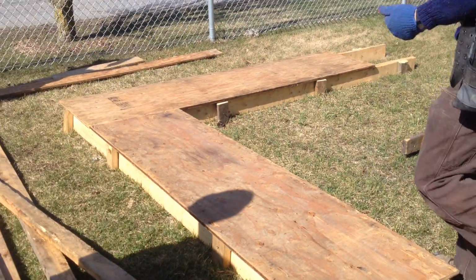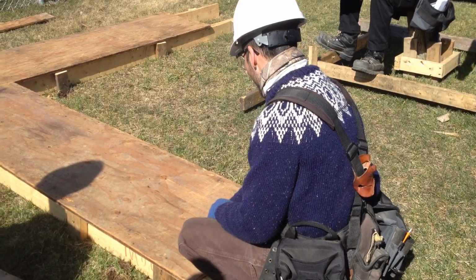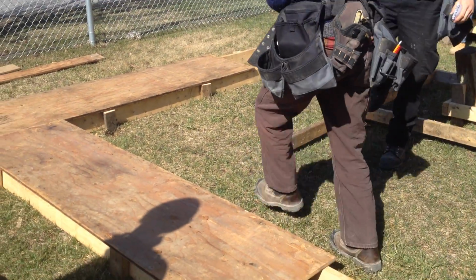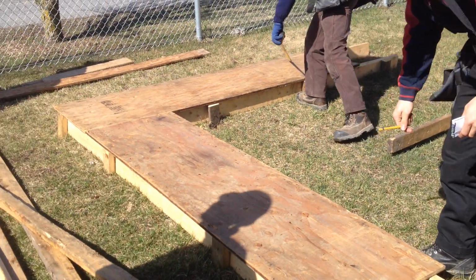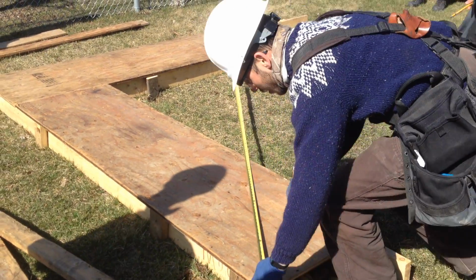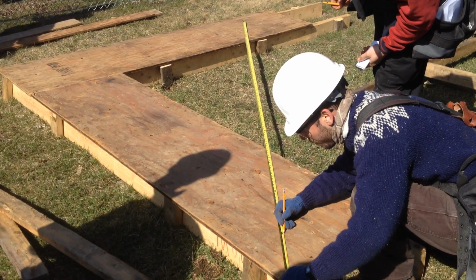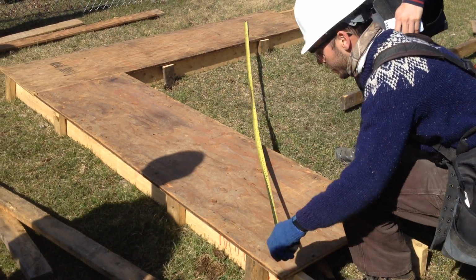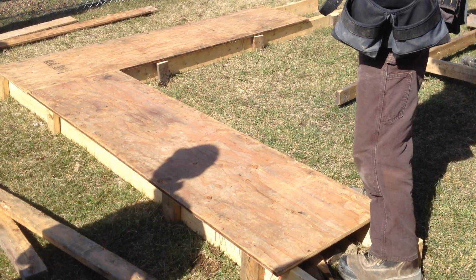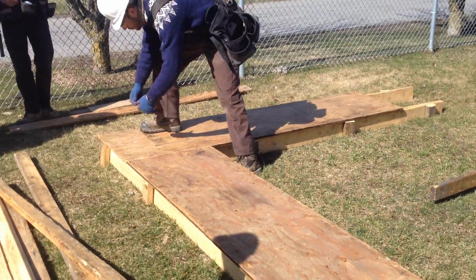I didn't have to do an arc because I went straight where they meet. I could have made an arc. Is that an arc? Yeah, that's my 6, and my 10 will come over here. That's your 8. Yeah, exactly. Correct me if I'm wrong. Okay? So where the two arcs meet is where I want to chalk across. So now I can chalk fast.